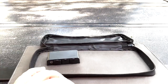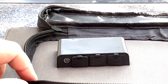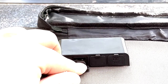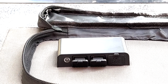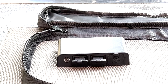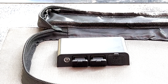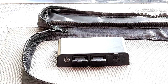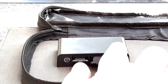Now with the cables out, let me give you a quick look at the connectors. You'll notice a little junction box — it's a bit different from the 60-watt version, which had cables coming directly out. This one gives you a junction box. You've got two USB ports: the left one is USB-A at 5 volts and 2.4 amps. The center-right port is a USB PD Type-C connector, rated for 5V at 2.4A, 9V at 2A, and 12V at 1.5A — so it does support fast charging as long as your device supports it.